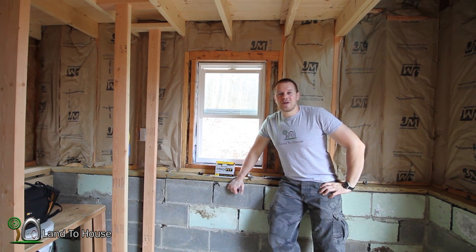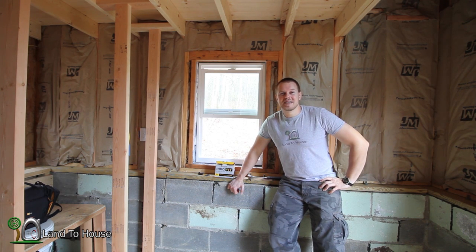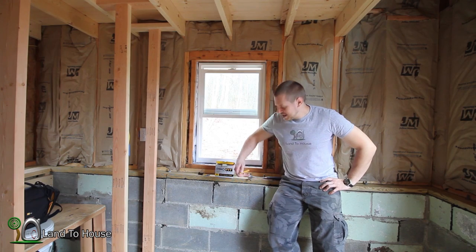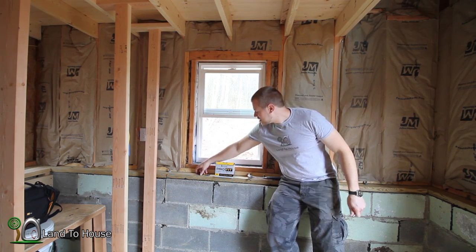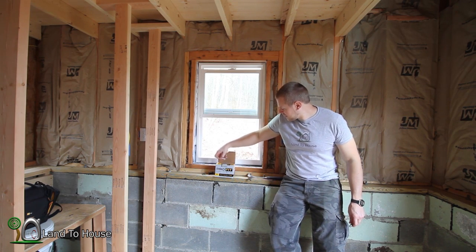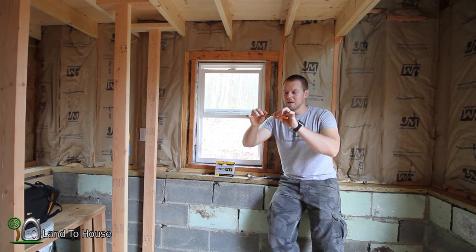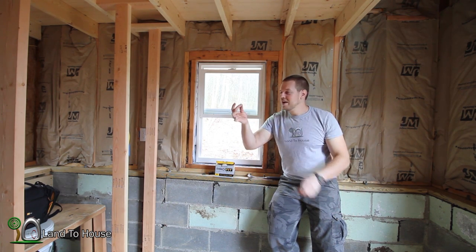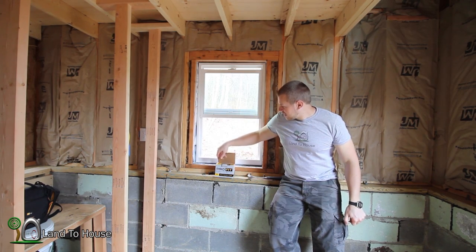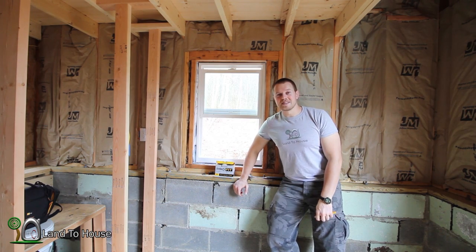So I just got back from my local hardware store and purchased 10 1x6 pine panels. Never done this before, so it's going to be fun and interesting. I purchased a nail punch, which is a 7/16 here. And then I got some 6D 2-inch long finishing nails. And so this will be able to go on here to finish that. I'm going to see if hammering into this will split the wood. If it does, I've got the drill to fix that problem.